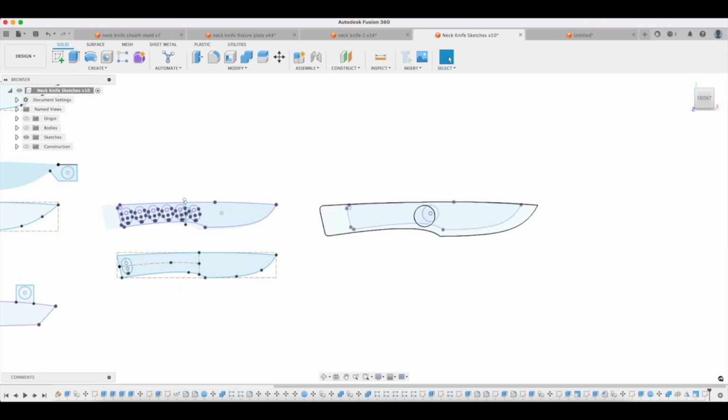But maybe you want to use a drill guide so that every single time you do this, you throw the drill guide in there and you can do 2 holes that are 3 inches apart. Well, this handle is too short for a 3-inch drill guide. What if I don't have a 1.5 inch drill guide? Then maybe I have a 2-inch guide, and so I want to extend this handle just so that I can fit that drill guide. I'll talk more about manufacturability later, but my point is that most people tend to think that function and aesthetics, how it looks, are going to be the 2 main things that you think about. Those play into it, but you always have to balance those 2 design qualities with, okay, can I actually make this thing?